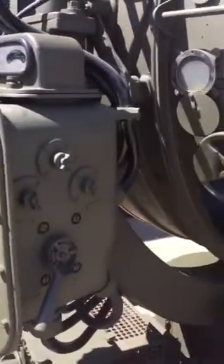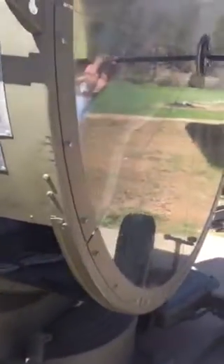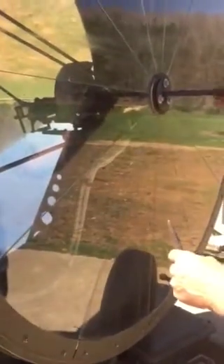I'm going to describe how I insert the rods. The first thing I do is stick my positive rod through until it starts going through the rotating head. I'm going to raise this up, climb inside, and stick my negative rod in the resting spot so I can let go of it. Then I'm going to adjust my positive rod and get it with the nose cone about three quarters of an inch away from the nose cone. Then I'll bring my negative rod in and make sure that it is about a half an inch away from my positive rod. Once that's done, I'm going to lock my positive rod in place and lock my negative rod in place, then come back out of the drum.